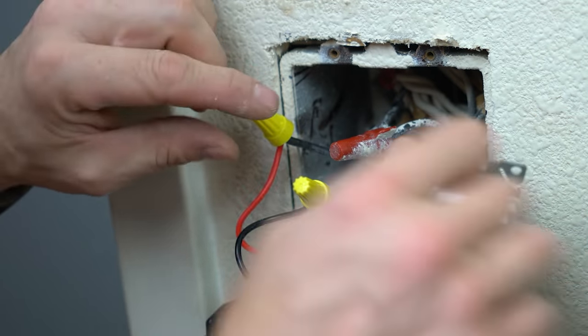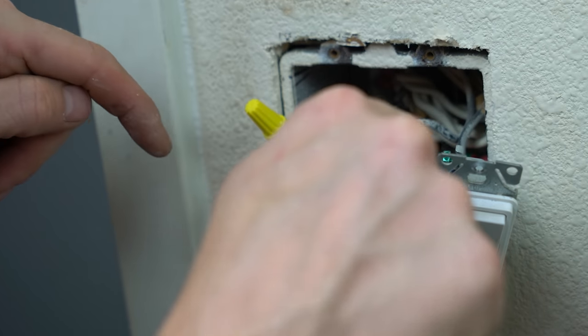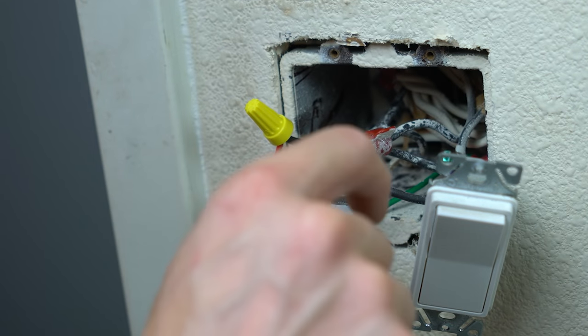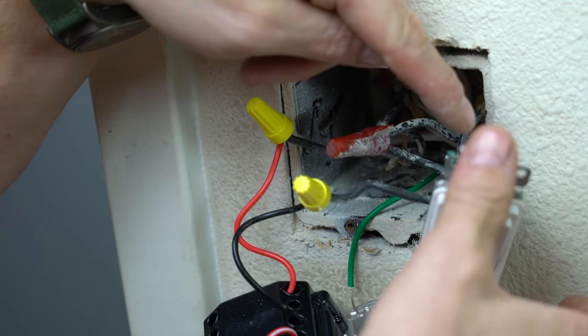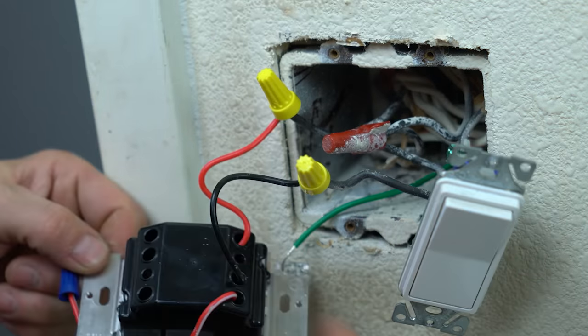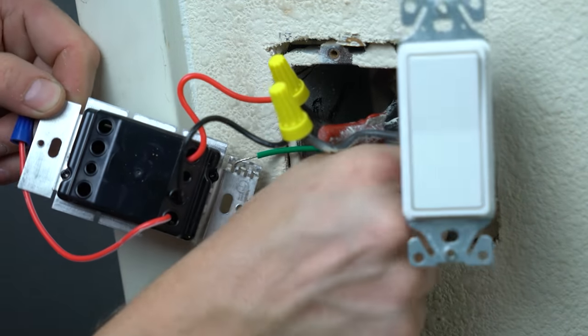connecting. What I am going to do is take all of that stuff off and create one wire nut with two pigtail wires going off of it. And essentially, it's just gonna clean it up a little bit more. And you notice too, there's no ground right here. There's a ground hooked up here, which is great. You know, they ran a pigtail back here.